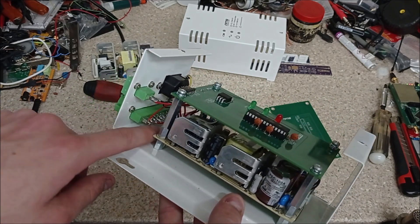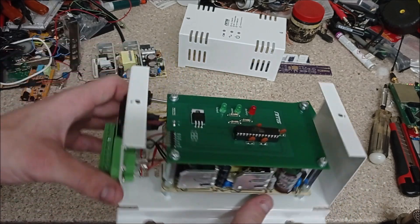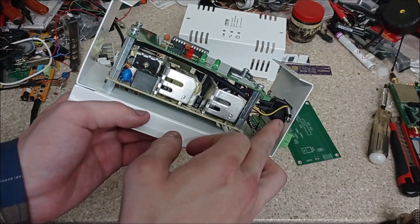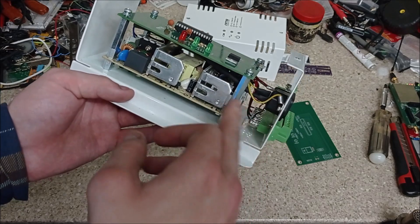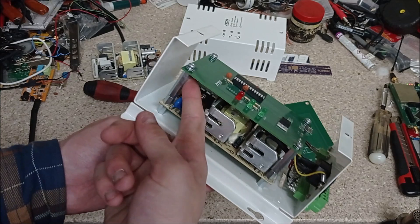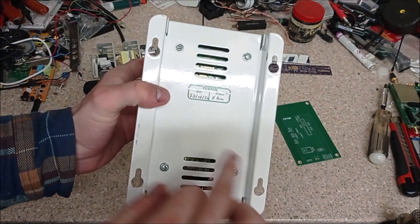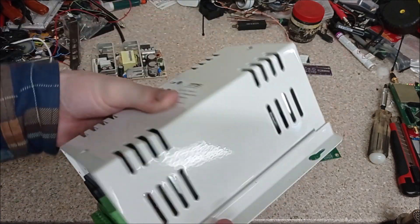Looking in here you can see the back of the connectors and how they connect onto the power supply. We have our 12 volt battery connector and our output connector, which has been joined with a big lump of copper to make sure it handles all the current for all the outputs. This is mains powered and it's metal, so we want to make sure it's really well earthed. I have a bonding tag connected to the earth pin of the C13, and I've run basically full 10 amps through every exposed piece of metal to make sure everything is properly grounded. I also rubbed the paint away underneath the screws to make sure there's a really good earth connection there.